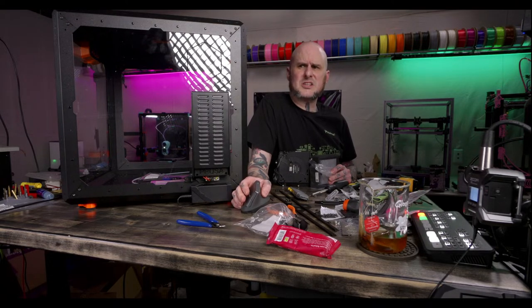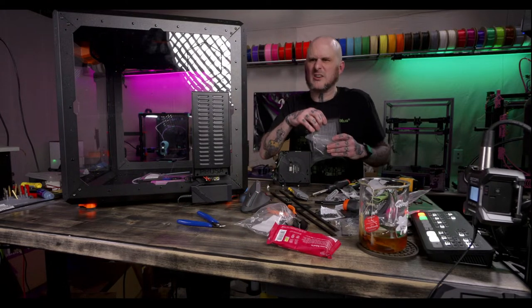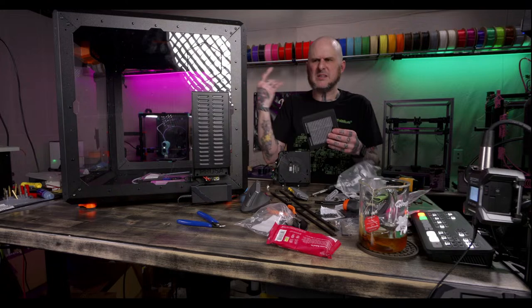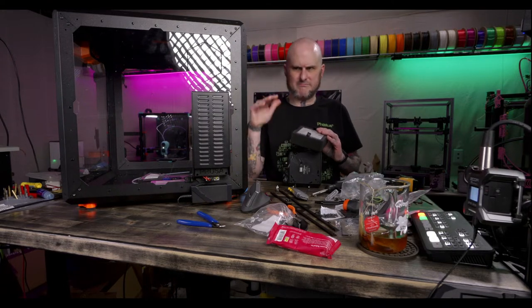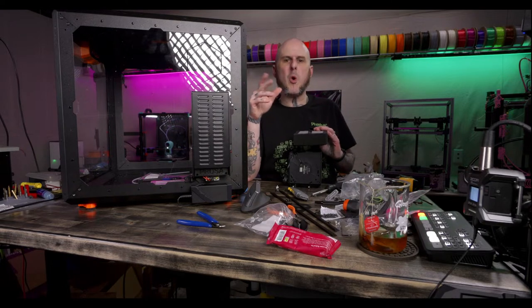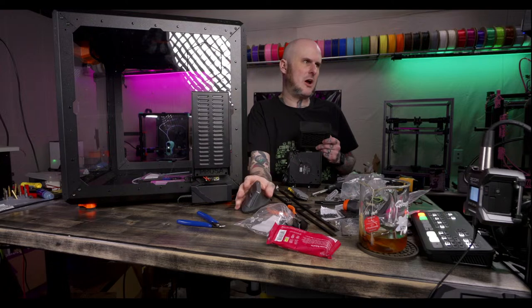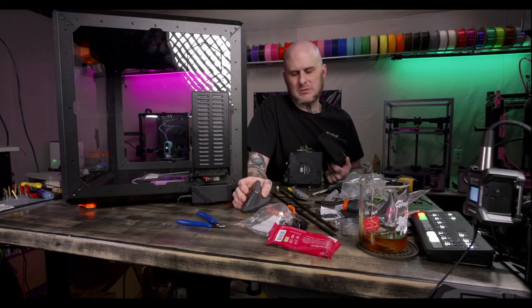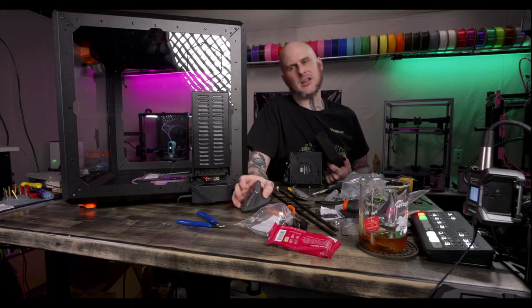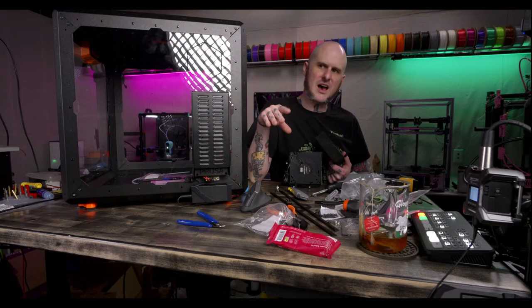Do you ever need to adjust the auto Z offset? Sometimes, rarely. Sometimes I might need a baby step still, but it's usually like 0.01, very minimal baby stepping to get it where I want it. And more often than not, I think the problem comes down to my end stop switches being maybe just a little bit sticky. I think those are the bigger issue.